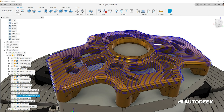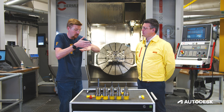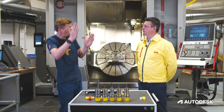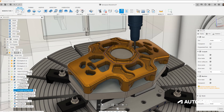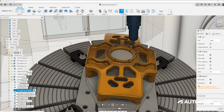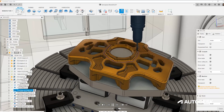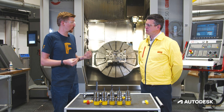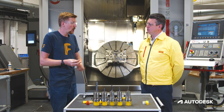In some regions we think about step over as we step over the parts. However, if the part is really steep, a step over can mean a huge step down. That's why we need those two ways to separate the part into two strategies. We also have some really nice features with superior tool axis control.